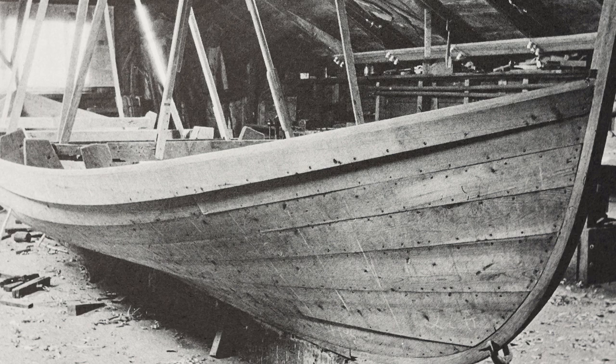In this photo, if you look about 4 feet back from the stem, you'll see that the number 7 plank starts to taper into the number 6 plank until it reaches the stem, where it's just about totally flush. I've also seen examples where the number 7 plank continues overlapping its full length. So I'm going to go out on a limb here and say that either option could be correct. Your call.